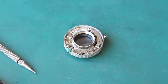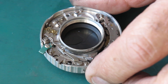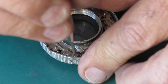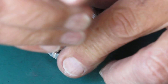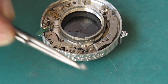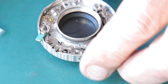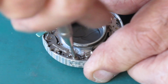I'll see if I can zoom you in a bit. I'll start by removing this gear over here — this is the flash sync mechanism. This is the B lever I'm taking off now. There's its return spring, there's the B lever. If that's got its end broken off it doesn't work. You don't see that very often, but it's one of those things you do see from time to time.